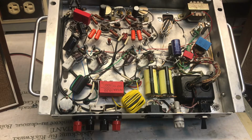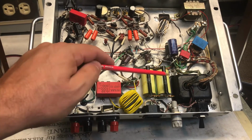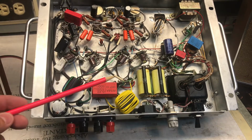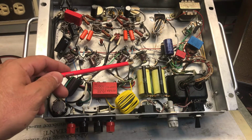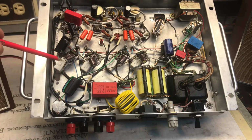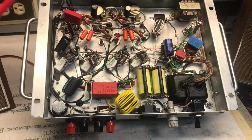and let me talk to you more about the whole circuitry. So what I'm using here, these are my smoothing capacitors, and a simple choke. And as you can see, each tube has its own bias resistor, bias capacitor, and that's pretty much very simple. This is a simple choke for the preamp. So let me zoom in so you can see a little bit more.